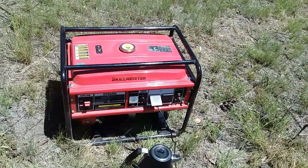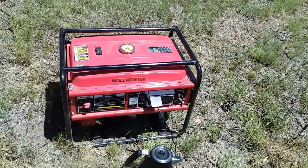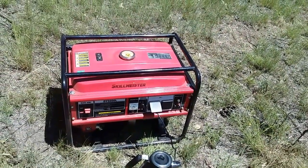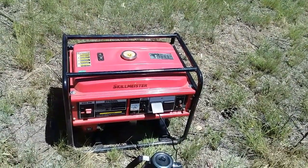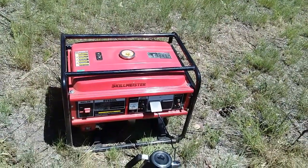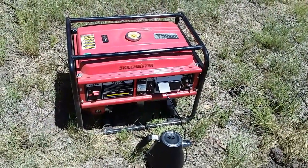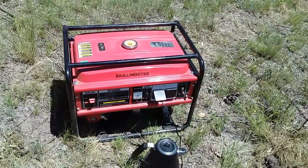So for every opposition of magnetic field, there is a shaft torque exerted on the rotor, which is entirely a function of the magnetic field itself, and therefore the current that is drawn from the output coils. So we're going to start the generator up and switch the jug on. I'm going to show you the difference between a loaded generator and an unloaded generator, which should be extremely obvious